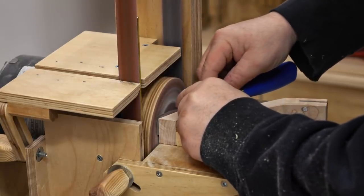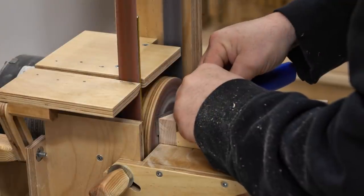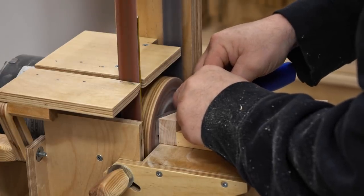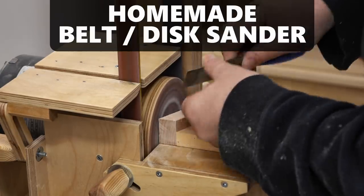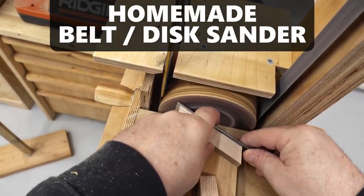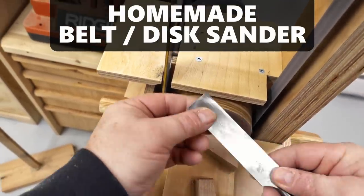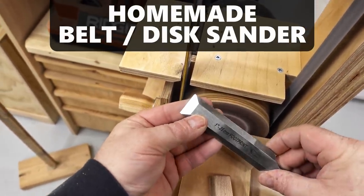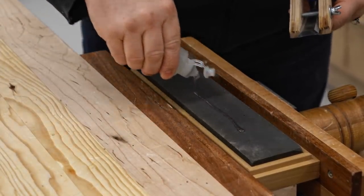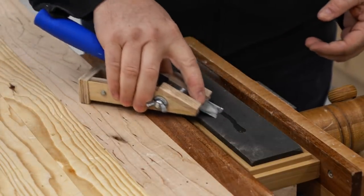This is another jig that I came up with a few years ago, and if you want more details on this there's a link in the description as well. What this will do is bring that primary bevel back and grind the whole thing flat. The only thing I have to watch out for is not to be too aggressive and let the steel overheat. It took a while to get it ground down to where I have most of the chip taken away. It would take a lot more to get rid of it a hundred percent, but I think I can get the rest on a secondary bevel.